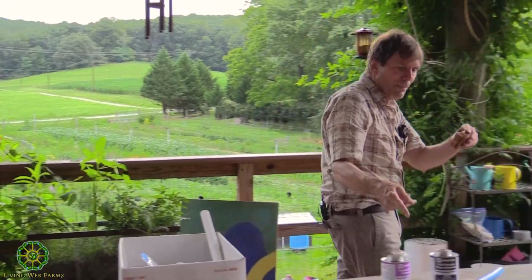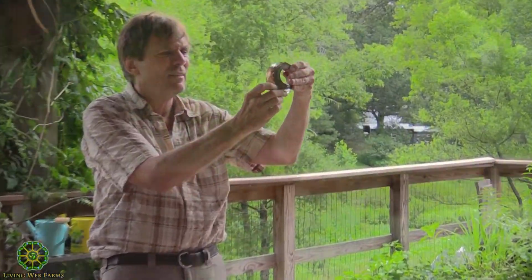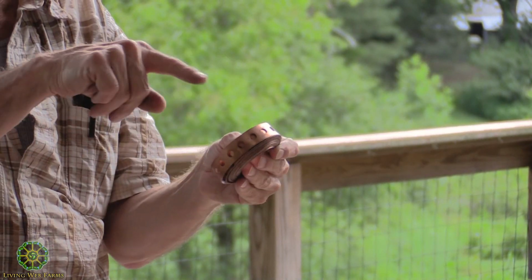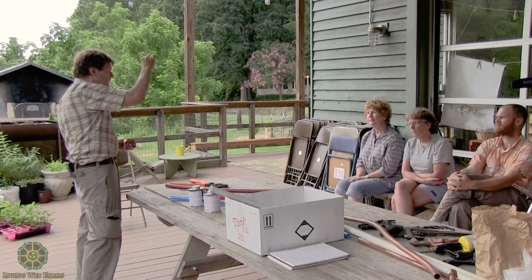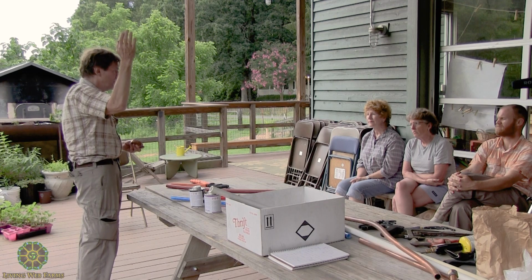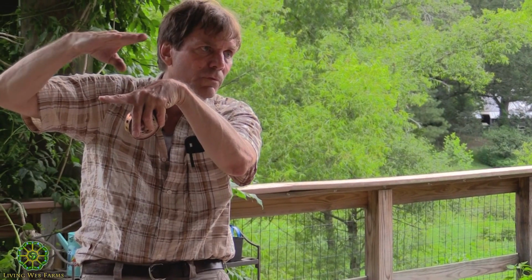This is used with copper when you don't insulate it, but normally it's a galvanized strapping. It looks just like that, except it's silver or galvanized color. And you just take a piece of it, make a loop, like that, hang it, and then you put a screw through into the joist or the support beams underneath the house, and it'll hang. You don't want it to hang down like that. You want it to be close to the framing, but let it hang so you can keep it even, and you don't really want pipe to sag, because it'll stress it after a while, after years.